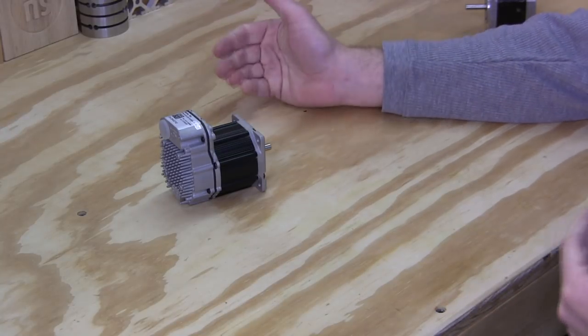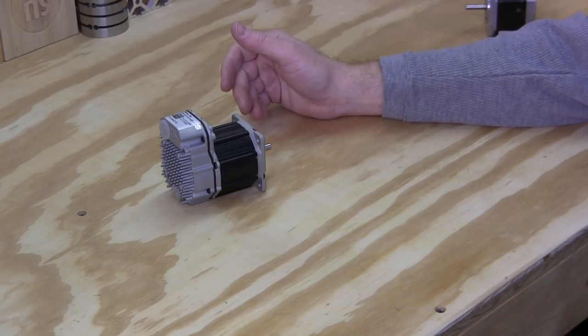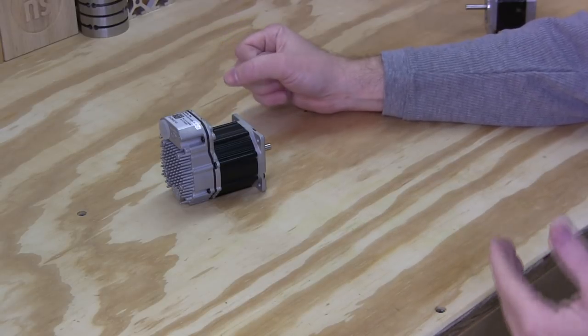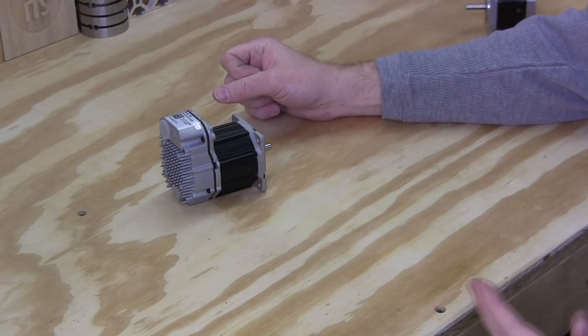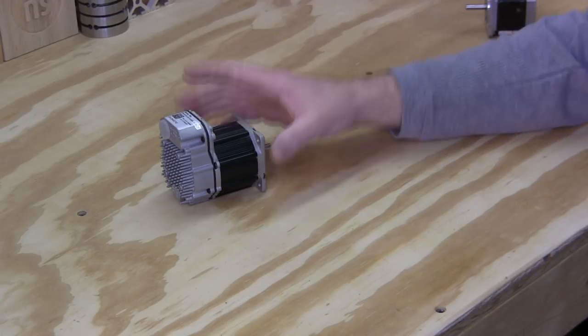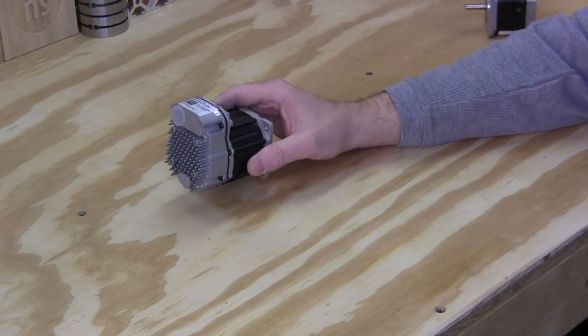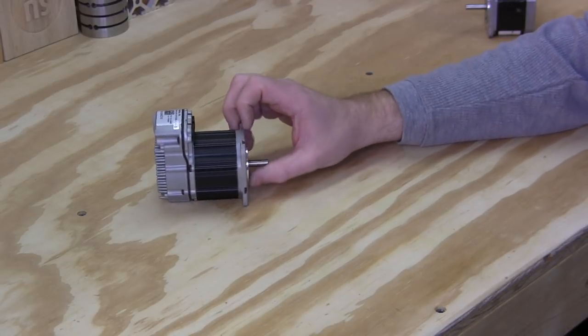As far as max travel and min travel, what that means is how far back can the motor go or how far forward can the axis go. What I typically have done in the past is I use a proximity sensor, and I let that be a home sensor. The Teknic ClearPath motor has a very interesting, a very nice feature, and that is,